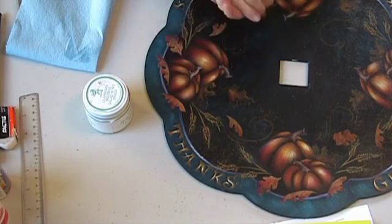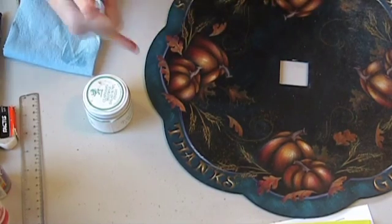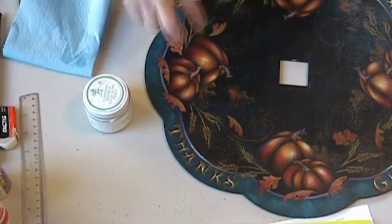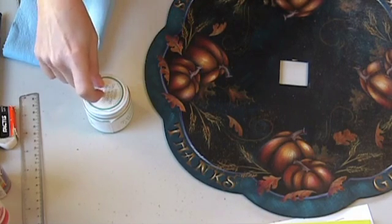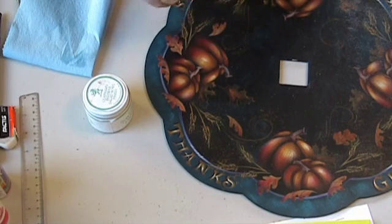That's what I recommend for anything that's going to be of quality and last. If you want it to be timeless, then take the extra steps with the finish. So for 3 to 5 coats of varnish, you will wet sand, you will then wax, or you can revarnish and then wax. And then you can refresh this as you need to. You can put another coat of the wax on as well. So that's going to give you your most wonderful, rich, elegant finish.